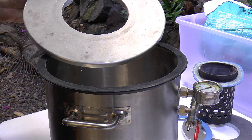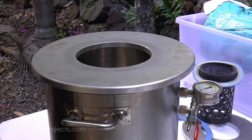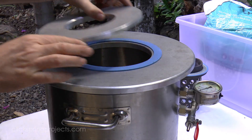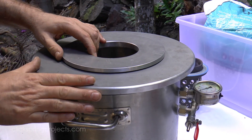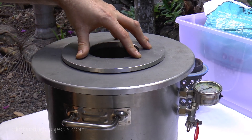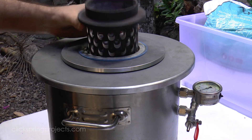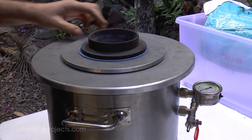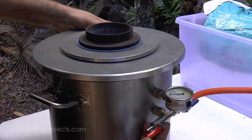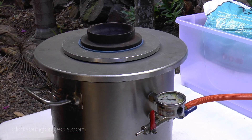Now the adapter plates work pretty much the same as for the commercial machines. This largest plate accommodates the 6 inch diameter flasks, and also acts as the main base plate for all of the other plates. Every other flask sits on top of this plate, with the appropriate adapter plate and gaskets in between. Once the flask full of investment is taken from the kiln prior to the pour and dropped into the adapter, the weight ensures a good starting seal. And then the vacuum pull just makes that seal stronger as the vacuum builds.